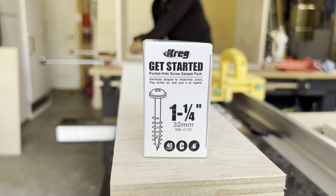We got the one cut, and it's not going to be a perfectly square line cut from one end to the other — that's why we didn't throw it on the table saw — because what this is doing is actually scribing itself to the wall. Now that we got that first one cut, we can show where the T-track is going to attach to the base. The gap here should be about three-eighths of an inch, which is not going to be a big deal because we just use a little bit longer T-bolts to run in the track. Now we have this back piece perfectly scribed to the wall, as well as this end perfectly parallel to the fence of the miter saw itself. So now we can go ahead and secure the T-track down in place, then remove the top and finish it.